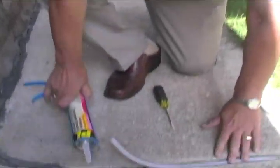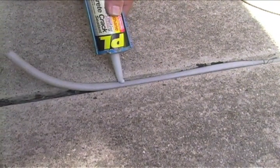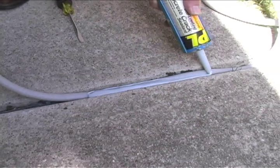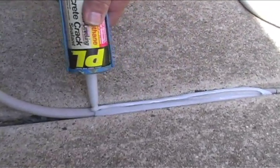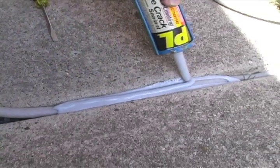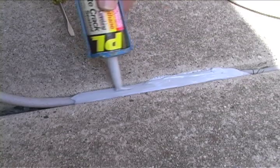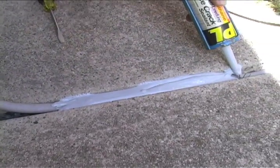Then when you fill it, spread the filler right over the top completely. Start the tube and push some out — that's all we're really doing. This is self-leveling, which is nice on a sidewalk surface like this because it'll level itself out; just squeeze it into place. If you want to disguise the appearance, throw a little sand on while it's still wet and that'll fill in nicely. The self-leveling stuff will smooth out and stay waterproof.